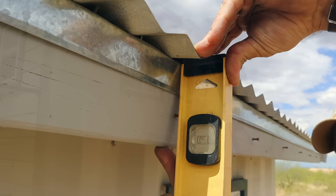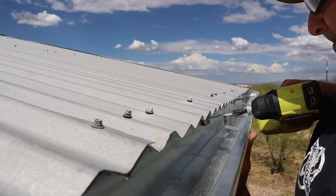Also make sure the bottom of your gutters is level so they have maximum capacity. Whenever you have fascia board that angles inward, the gutters will lean down. I'm using screws to shim the gutter out to keep that lower portion of the gutter level to the ground.